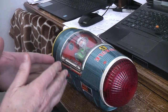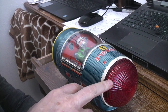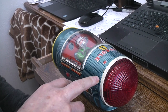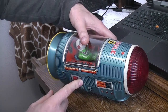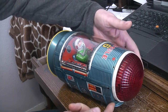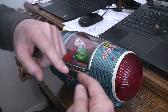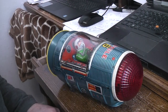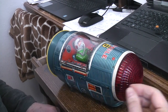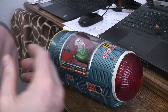In other words, it was shorting the 4.5 volts out to ground. That was why there was no light effect. But it isn't a total short — as we've talked about on these toys, there's a connection from the switch to the frame, then from the frame to the motor frame, and from the motor frame there's a connection to the spinning light effect, plus a commutator with wipers so that the lights can spin and stay lit. So there isn't a 100% short to ground no matter what, because there's resistance at all those points where metal is touching metal to make a connection.